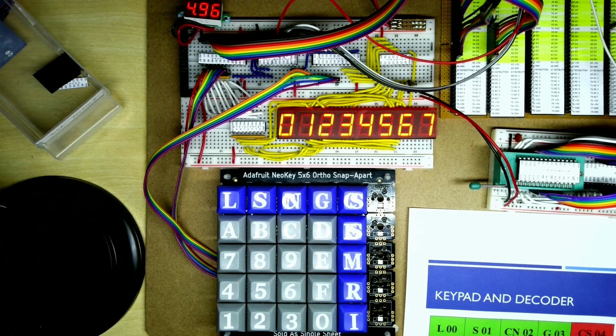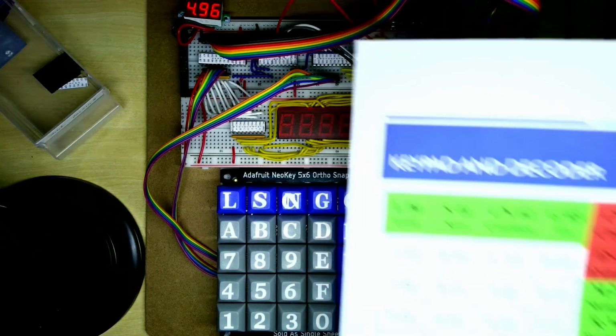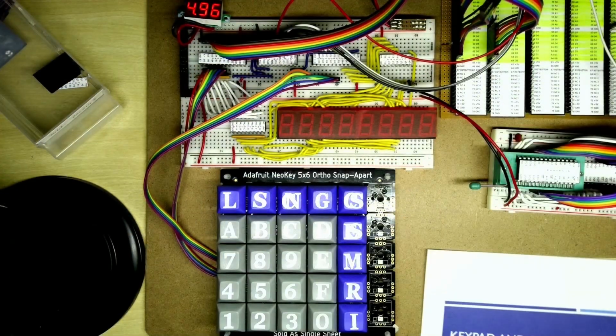And this is the alternate side. I can't remember which way around it is, left or right, which is first. So that's showing 0 to 7 and then 8 to F. So all that's showing is that the software that's being used to display the key code is actually working. And now after we press key now, each time we press a key, we should actually get the key code coming up. So we're really just going to check it off against this here.